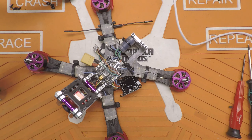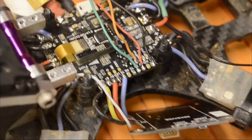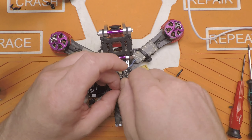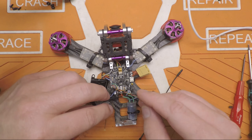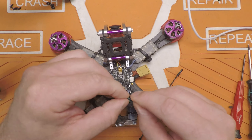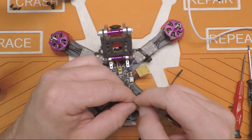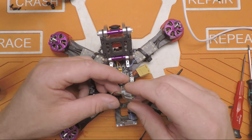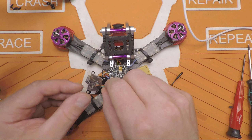So that's it for our connections — real simple. I'm going to turn this around and twist up these wires a little bit, just make them all nice and neat. Love silicone wire, it's so easy to work with. I'll go ahead and hook up my antenna, and add a little piece of heat shrink. I just don't want this to accidentally arc and spark on anything.